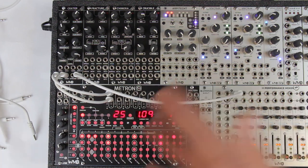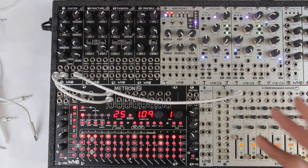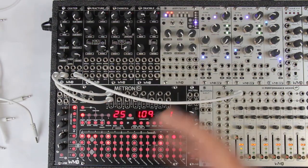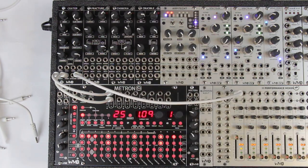Now moving to the digital side — this is where we get even more attack. The pitch envelope adds some attack but we don't have a high-frequency click. In produced music you often hear different layers of kick drums with a hi-hat sample filtered in to cut through the mix. So we built a synthesis engine with a click timbre control. Click decay is an envelope over those clicks, and turning it up engages a noise circuit that does a little bit of delayed noise to simulate sympathetic room vibrations — kind of a snare rattling or body sound.